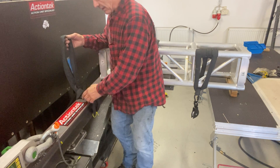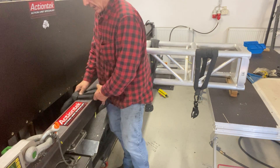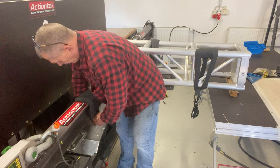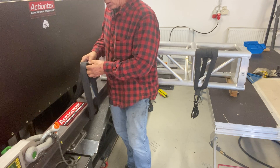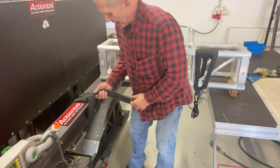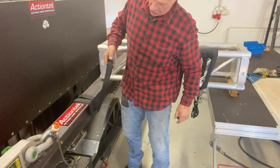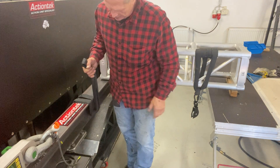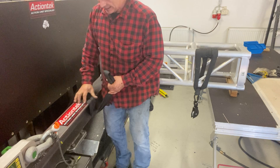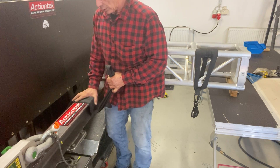Now I don't like something loose like this, and obviously an I-beam in the ceiling you would have padding around it. I would also try to come up with the best way to get the right size span set to shorten this so I didn't have this long loop. I might get a meter and a half, but here the load is going this direction — it's choked. So as load is put on it, it tightens around the beam and it's pulling back against the choke, so it will orient.